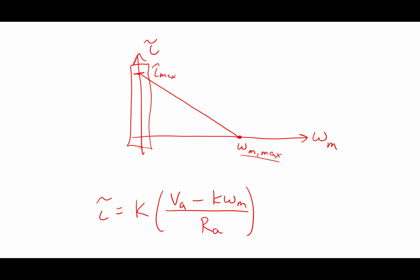Again, they don't have DC motors there, just to be clear. But it's true for basically all motor types that you have a lot of torque produced at low speeds. That's an important concept to understand. You've experienced that acceleration if you've been in a Tesla. You experience acceleration because you've got a lot of torque. Think about it: it's the moment of inertia times the rate of change of speed. That's why you're accelerating fast, because a lot of torque is being applied. Anyway, we'll stop there.